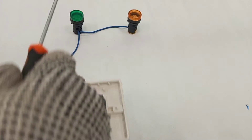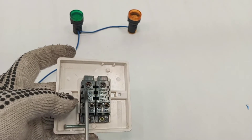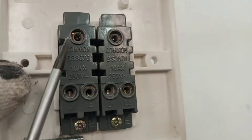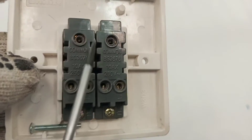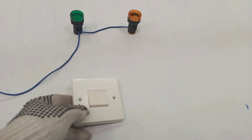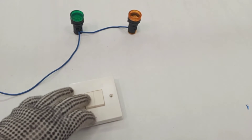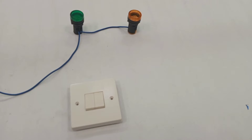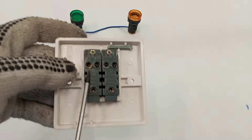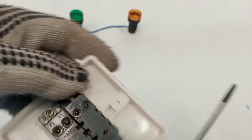We are going to wire one of these two-way switches to one lamp and the other one to the other lamp. Though this is a two-way switch, in this case we are going to use it as a one-way switch — using the common and only L1. I made a video explaining the various ways you can use a one-gang two-way switch, and I've shared the link below, so please watch that to learn more.